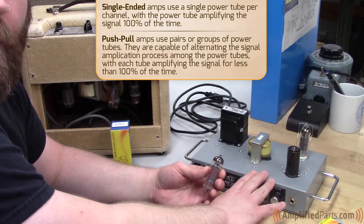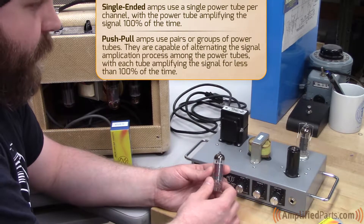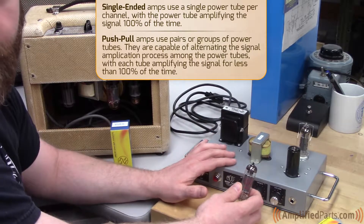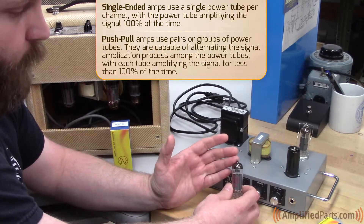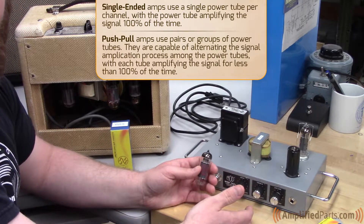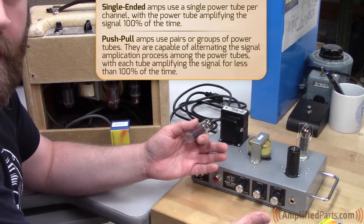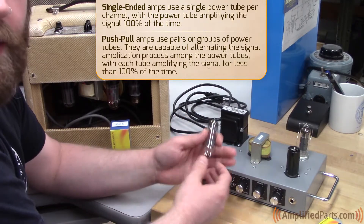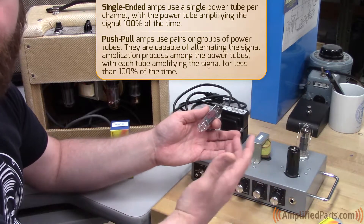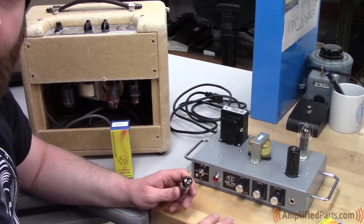This particular one we actually goosed up to right around 8 watts of output power at its max, so it's a hot little amp for what's powering it. But generally you're looking at about 5 watts output in single-ended. If you've got two EL84s in a push-pull operation, you're looking at about 15 watts — that's like your Blues Juniors, your Vox AC15s, etc. If you get into four EL84s, you're looking at about 30 watts, like an AC30. So that's about it for the EL84.